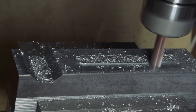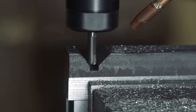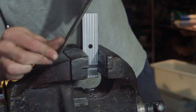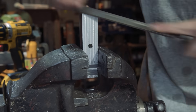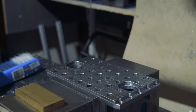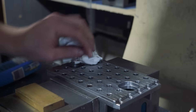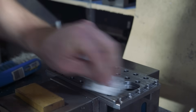The next part was a simple one with just a flat face, a hole in the centre and a relief matching the profile of the lathe's bedways. Because the lathe I'm fitting this to is on the other side of town, I left a little extra meat on the flat so I could make fine adjustments to properly fit it later. Moving on to the pads, I could have avoided a lot of frustration if I'd simply made this radius slightly bigger. As it was, I'd need a 4mm end mill to match it to the profile of the fingers, and because I'm lazy and hate tool changes, I decided to do the roughing with the same 4mm end mill.